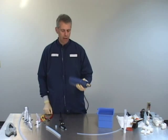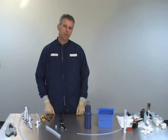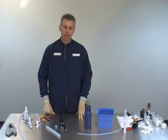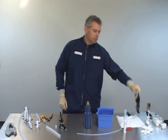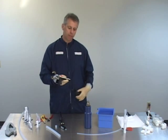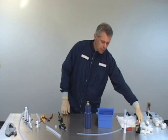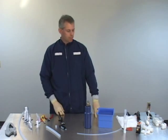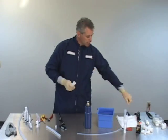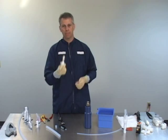The next thing required is a hot air gun. The hot air gun needs to have a tip temperature of about 1,200 degrees, which will allow you to stay within the temperatures given in our instruction sheet. Another option is an infrared glow ring — the tools are fragile, but they can be used if you can't have hot air blowing in your fab area. If we're going to be doing Flare Lock 2, you'll need the grooving tool. The white tool is for Flare Lock 2, versus our older integral ferrule style tool which is blue.